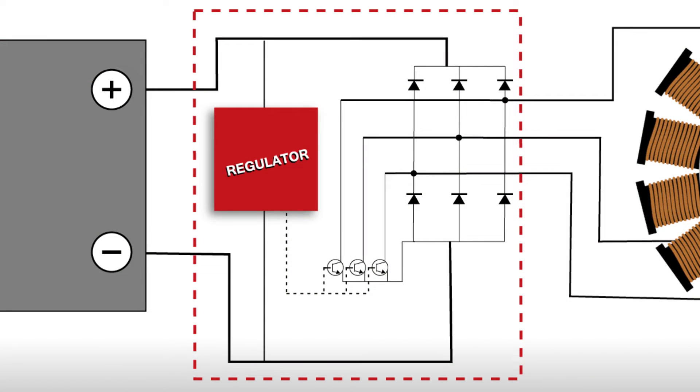I think I can explain why. When we put positive here and forward biased going back, it had no problem — it was going against the gate so we were only reading those three diodes. But when going the other direction, we were actually paralleling a forward-biased diode with whatever circuitry they're using inside the regulator on the other side. So when you try to forward bias those diodes, you're also forward biasing different transistors inside, which gives you a different reading other than the expected 0.5 volts.